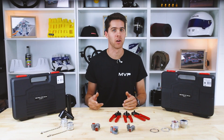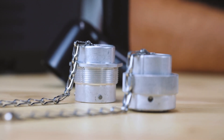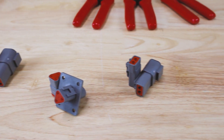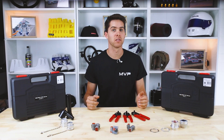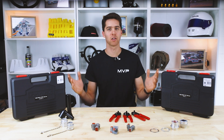Protective dust caps and wire boots are also available along with blanking seals, spare pins, and more. The complete range of Deutsch connectors may be found at raceworks.com.au. These are a much higher end connector than your simple nylon connectors, offering much greater reliability, lower resistance and a longer lifetime.